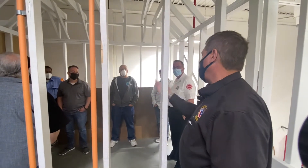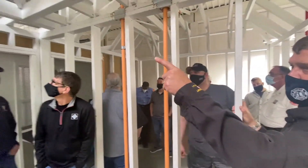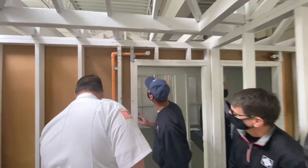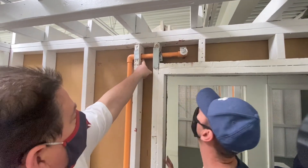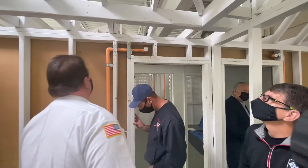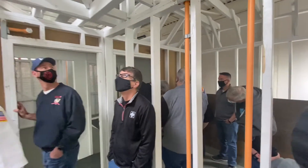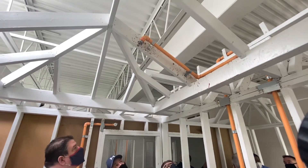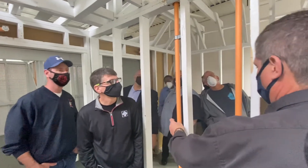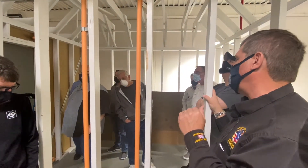As long as the room's not too deep where one head can't cover it, that was a good retrofit approach. Now you're going to look at the pipe — the size of the pipe, the diameter. It's marked on there somewhere. Can you see on this pipe what it says? Looks like one inch. So when you're doing field work, you've got to check: does the drawing say one inch, inch and a half, inch and a quarter? You've got to verify the proper pipe is installed, so you've got to get in and inspect these places.